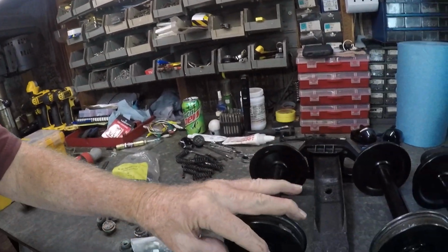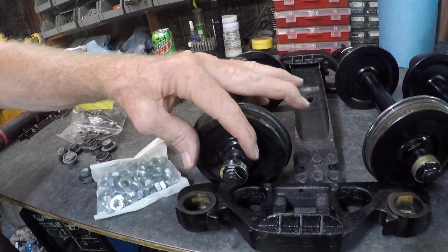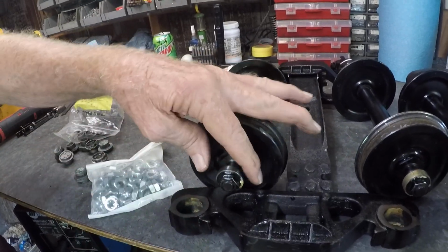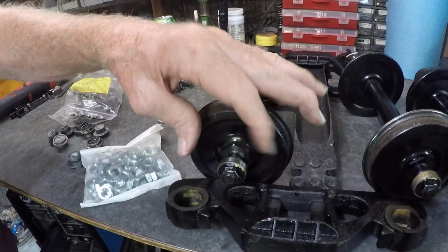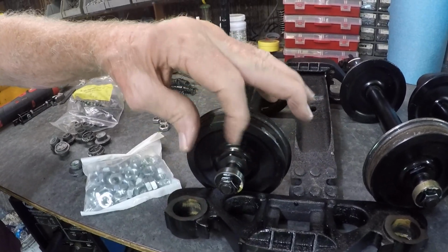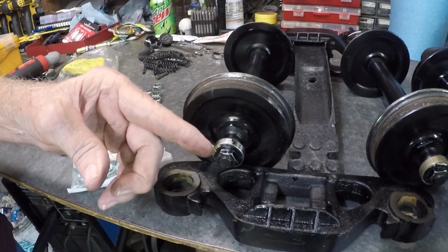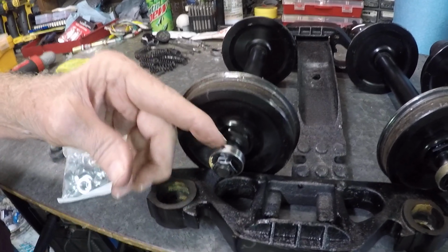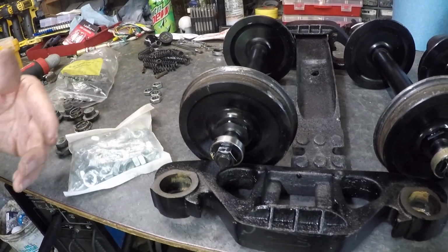But they've got to be on there in order to hold this bearing in place on the end of that axle. So if they're not there, this bearing gets hot. It gets warm while it's going down the track, hauling the passengers like we do, and then it'll move on that axle, because the Loctite that's holding it in place gets warm, and therefore the Loctite will move.